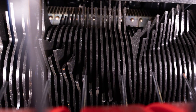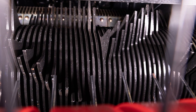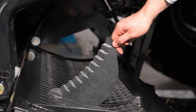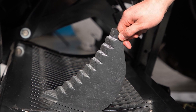Initially, the LB436HD is offered with a rotor cutter feeder and 29 knives. For model year 2021, the Packer feeder model will be introduced. For increased capacity and ground speed, the rotor has increased to 108 RPM. The unique W-shaped tine pattern of the rotor ensures smooth crop flow into the pre-compression chamber. The tines are alternating between long and short to prevent rotor blockage. To size the crop, 29 selectable knives provide a short cut when needed or a customizable cut based on customer preference and need. Sizing the crop reduces tub mixing time when feeding and increases absorbency with straw when used for bedding.